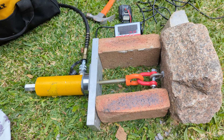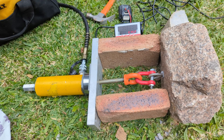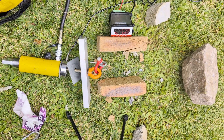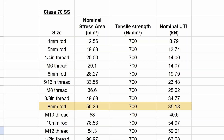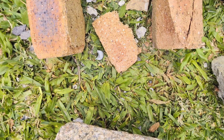We've got the little Atrax 8mm bolt in granite. 20... 24... 36, 37 — oh my god. 39 and a half kilonewtons for this little guy — about what you'd expect if you actually measure out the steel and everything, but still pretty impressive from an 8mm bolt. Steel failure, so the epoxy's okay.